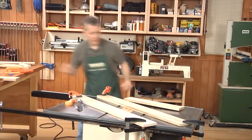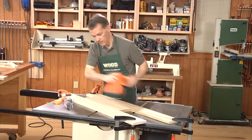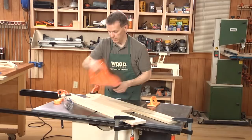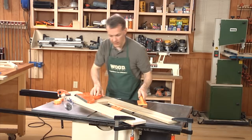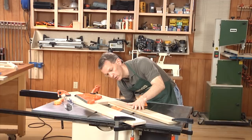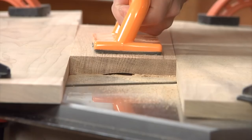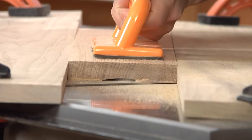Now, since the blade is going to be hidden during this cut, don't push with your thumb — use a push block with a heel that hooks over the back edge to push the piece through. You're making a cut the blade really isn't designed to make; you're pushing kind of sideways into it. So make very light, shallow cuts — no more than about a sixteenth of an inch per pass. This process makes a lot of dust even with a dust collector, so a dust mask or respirator is a good idea. That's not smoke coming out — that's just fine dust.